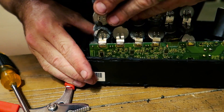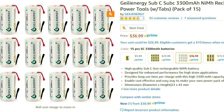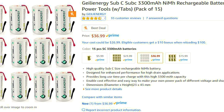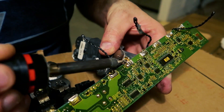Once I got the batteries out of the case, I realized they weren't that special — just 1.2-volt sub-C 3000 milliamp-hour nickel metal hydride batteries. You can get those anywhere. I hopped onto Amazon and after a quick search, I found these batteries: 15 of them for $36 and they already had the little welding tabs on them. So I ordered 120 of them. That'll put me right around the $500 mark. As long as I don't need any other parts, this project may be a success.